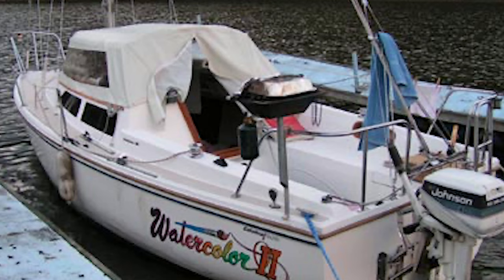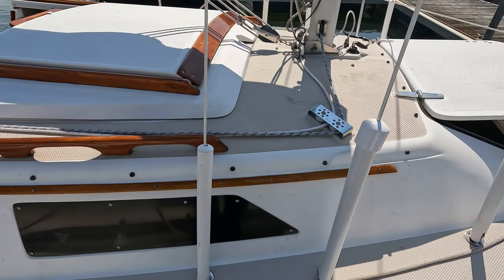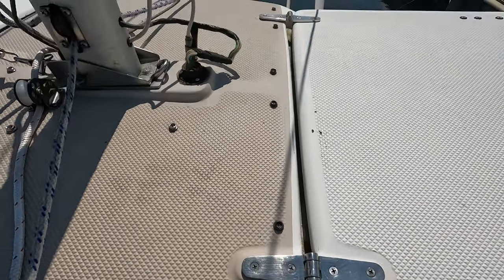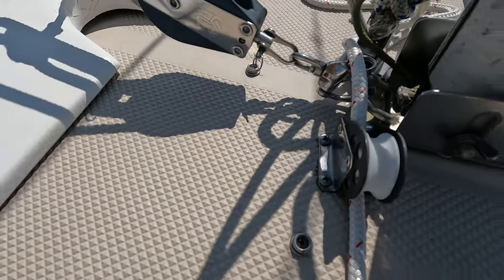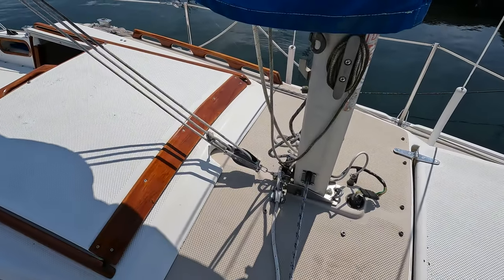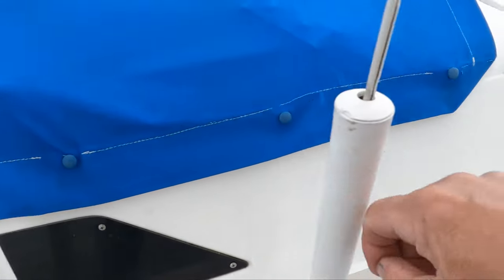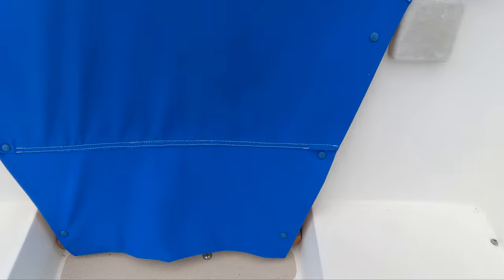My Cat 22 has a pop top with a waterproof covering that attaches all the way around the perimeter of the cabin top and down the companionway trim for a waterproof zippered doorway. I have used these attached cabin snaps around the cabin top to attach this canvas cover, with the cover sides being extra long to hang down over the window eyebrow teak trim below the snaps. Only an additional 5 snaps were added around the base of the mast to hold down the canvas from wind ballooning this cover.